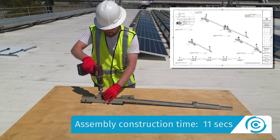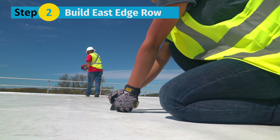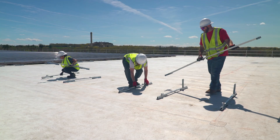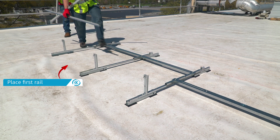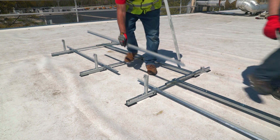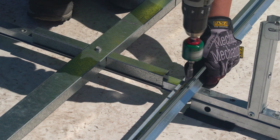Assembly quantities are always shown on the racking construction set. Step 2: Build the east edge row. Starting from the easternmost row, mark the array perimeter and the racking base edge. Place the east assemblies using a spacer stick, lifting the module connector tilt arms as you place each assembly. Place the first rails on the first two assemblies and then on every other set of assemblies until the end of the row. Place the next set of rails in the gaps on top of the existing rails. With the spacer stick in place, bolt the rails to the east assemblies.